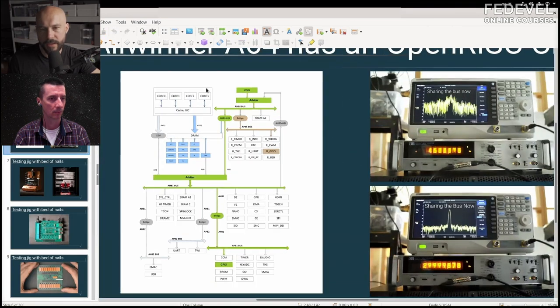This board is a little bit special because it doesn't have a separate external microcontroller. It uses a microcontroller on the system-on-chip. I do have a separate microcontroller, but it's a very cheap, very simple one that only does ADC and PWM — the temperature monitoring. The motor control microcontroller is actually part of the main processor on the system-on-chip.